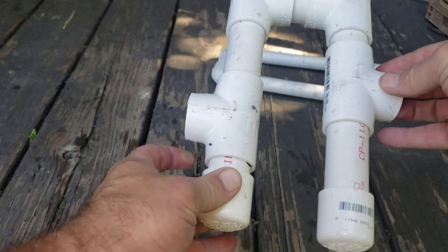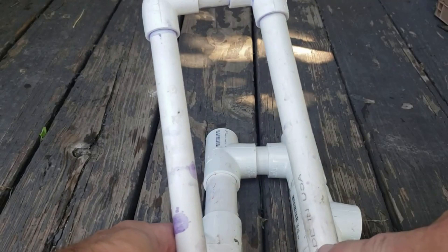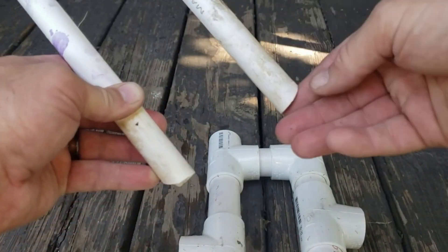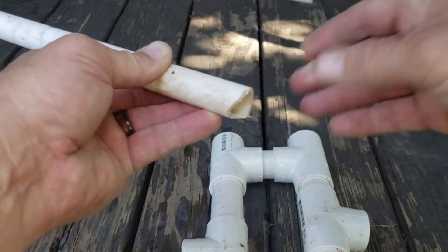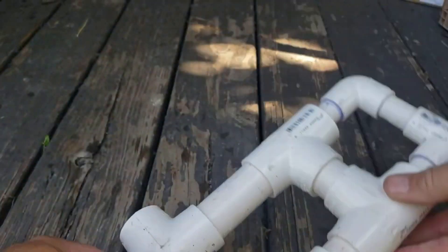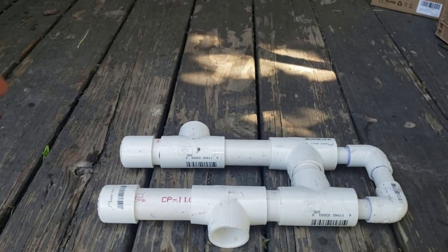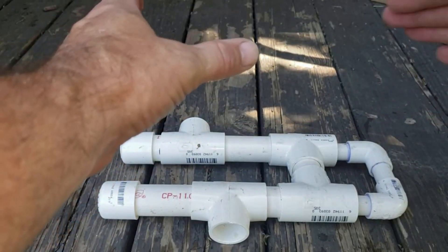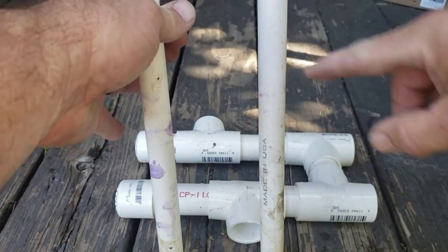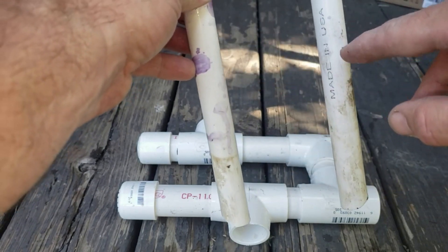This side slides inside the tank, this side is outside the tank. The inner pipes — about 11 and a half inches with the angle cut — slide inside the base piece and just drop in. Here's why this works: if you've ever seen two buckets sitting beside each other, you can create a siphon. When water fills up to the lower side it'll drop down and the water starts flowing. As long as water is sitting in the pipe you don't lose the siphon.